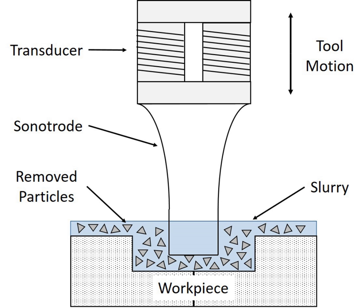Ultrasonic vibration machining is a unique nontraditional manufacturing process because it can produce parts with high precision that are made of hard and brittle materials which are often difficult to machine. Additionally, ultrasonic machining is capable of manufacturing fragile materials such as glass and non-conductive metals that cannot be machined by alternative methods such as electrical discharge machining and electrochemical machining. Ultrasonic machining produces high-tolerance parts because there is no distortion of the worked material, due to no heat generation from the sonotrode against the workpiece. Furthermore, no burrs are created in the process, thus fewer operations are required to produce a finished part.